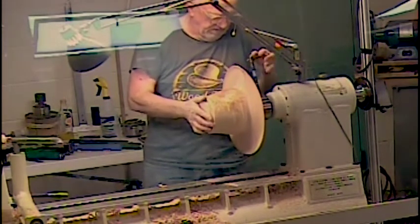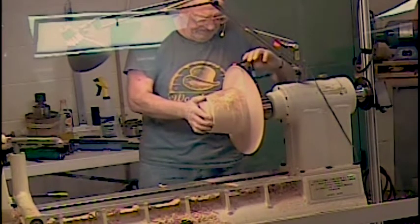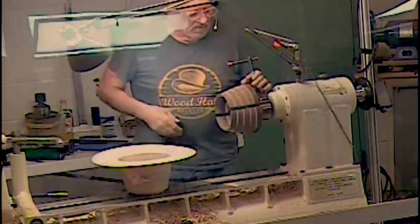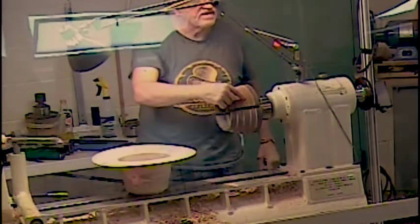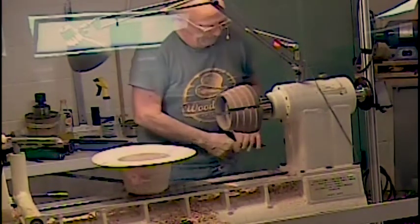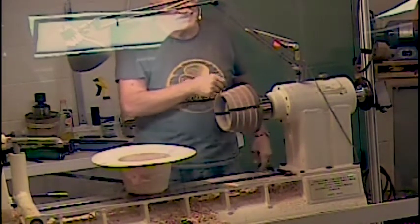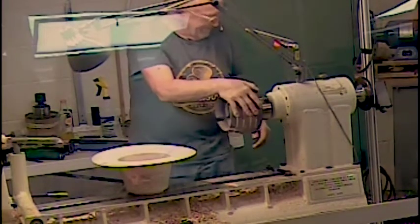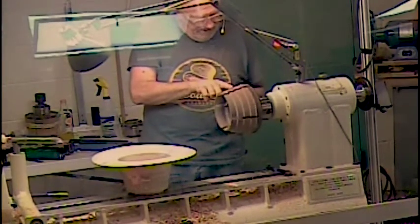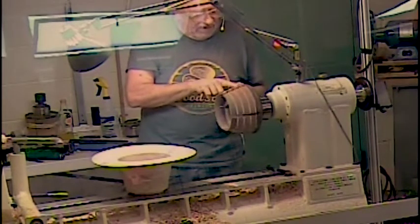And the reason for all the steps is that you don't really want to adjust this chuck very much, because the more you change it from where it was when you cut, the more... If you had this all the way closed and you cut this round, open it up, it's a bump and a bump and a bump and a bump. And that would work for turning, but when you start to burnish the band, it gets darker on the bumps, obviously. So you can see this is turned at about this setting, so they're pretty round. There's not bumps and bumps. So small, medium, large hats.